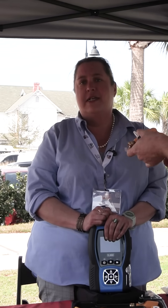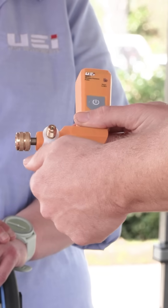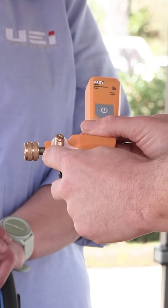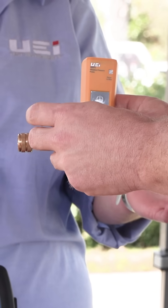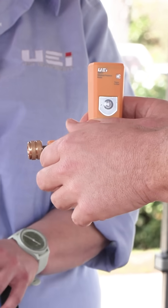This is the pressure probe, which is pretty cool for a couple of different reasons. If you take a look, it has a 180-degree swivel. On top of that, it actually has a pass-through port — built-in pass-through for charging, built-in. That's incredible. You don't need that extra T, so now you're able to get into those harder-to-reach spots.